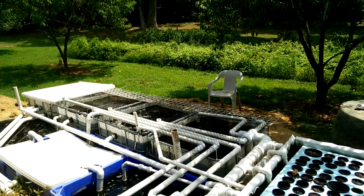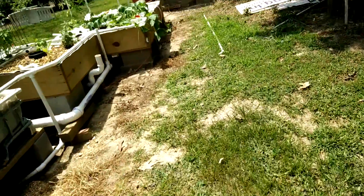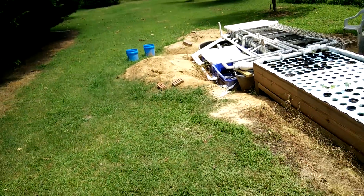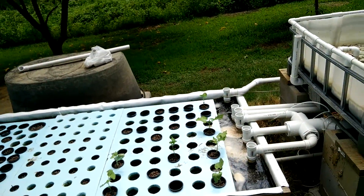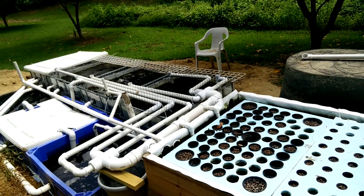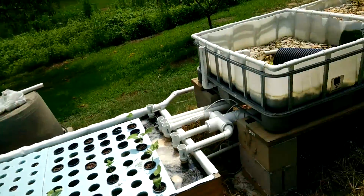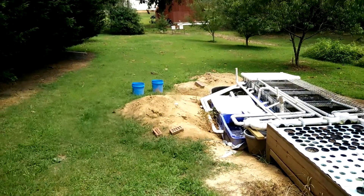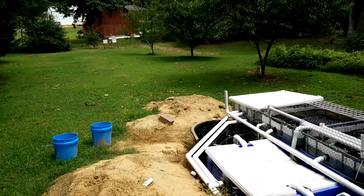If you don't have enough room for your sump between your sump tank and your biofilter, that's fine. If they come out even, I guarantee you, if you put enough bulkheads in it, your biofilter is not going to back up on you. The two places you cannot compromise: you've got to have at least six inches from the bottom of the pipe down to the top of the water going into your raft bed, and at least six inches going down into your fish tanks. With your biofilter to your sump tanks, you can line the side of it with bulkheads if you're elevationally challenged. Just have minimal drop and you'll be just fine.